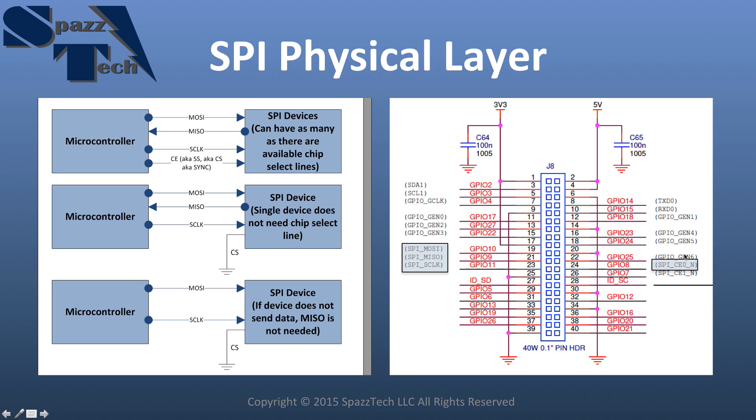Here is a schematic of the J8 GPIO header on the Raspberry Pi. You can see we have CE0 and CE1. In the basic configuration of the Raspberry Pi — on the B-plus and the Raspberry Pi 2 — you have two chip-enable lines, so we could have two Serial Peripheral Interface devices connected to the same SPI bus. In the example I'm going to show you, that's exactly what I've done.